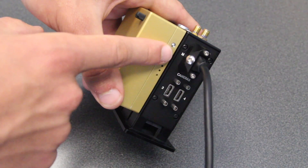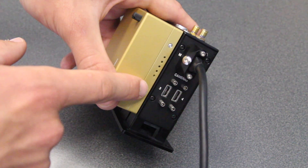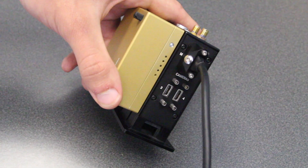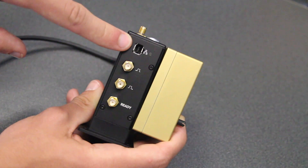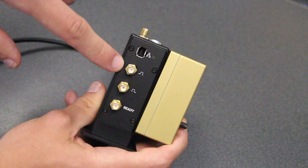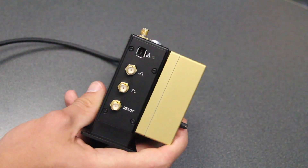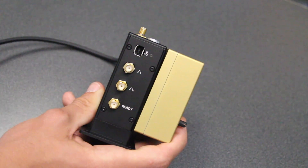Let's look at the camera ports. You'll notice an M next to the master port — this port provides the sync out signal. You can connect up to 4 cameras by using all 4 ports. On the other side, the Mini-IO connector is for Ethernet, which gives control and communication. Directly beneath the Mini-IO connector, you will see the sync in and sync out SMA connectors, which provide synchronization signals. Finally, the Ready SMA connector can give a signal that the camera is ready to be triggered.